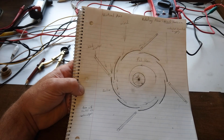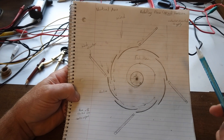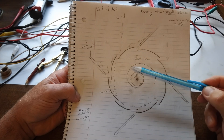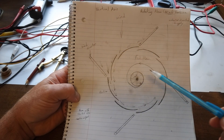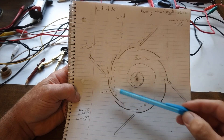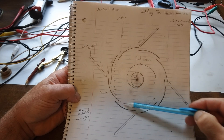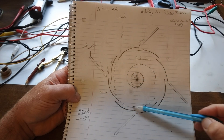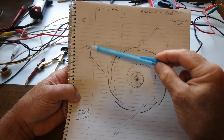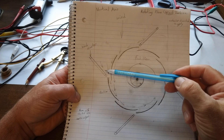There are many designs out there for vertical axis wind turbines, and I've got a couple of my own I want to try out. This first one is going to be similar to my rotating flow turbine I use for my steam turbine, except the wind will be acting from the exterior. Basically it's a drum with slanted slits on the sides where wind can enter and spin around, driven by friction as it strikes the sides — rubbing against them making the turbine turn, striking other air too, and then exiting out the center. I'd like to employ some wind diverters eventually, and these can also serve as a support for the turbine.